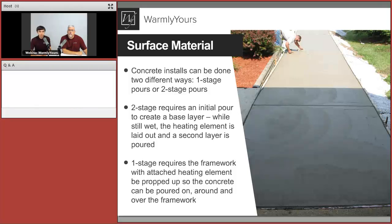We can also see what looks to be a control joint, or it can be the expansion joint, the line that separates those. And I can tell you which one is which, because what's the difference between this line and this line? Oh, yeah, it's nicely visible, right. So the pinkish styrofoam there definitely shows the actual expansion joint, and that's where we never want the cable to go across or do anything of that. But the line over there, the smaller one where the green arrow is pointing, that's your control joint, which is typically going to be maybe about half an inch or so.